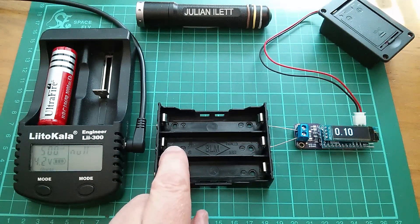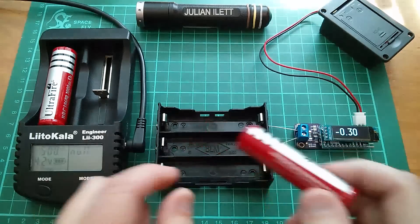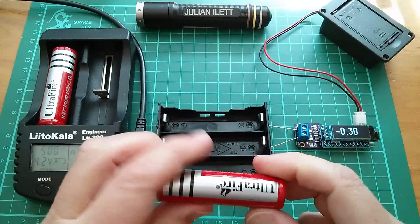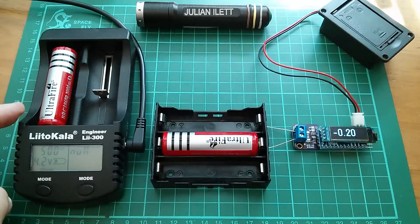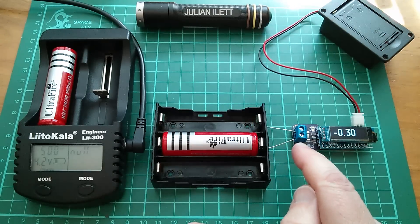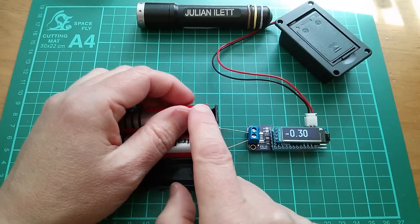The charged one still isn't done, so let's put the discharged cell in. I've got my plus symbol on this side and minus on this side because I was thinking of measuring current at the negative end, but that's fairly irrelevant as it's pretty much symmetrical. I'm going to put this in positive side to the right - it's a very tight fit. And then when this one is fully charged, it's going in there effectively in parallel through this 0.1 ohm resistor. The charger is now saying full - it was charging at 500 milliamps, so it should have dropped to about 50 milliamps before saying the cell was full. So this is now full and it's going in parallel with the empty one.